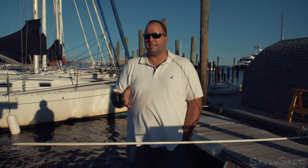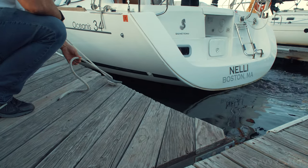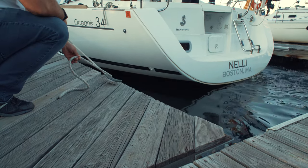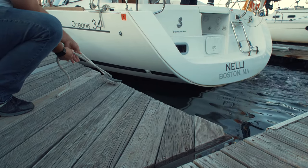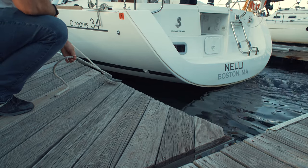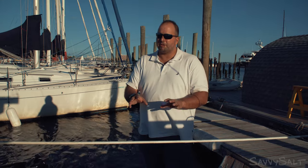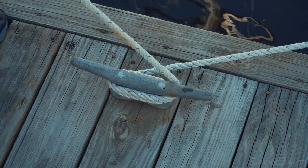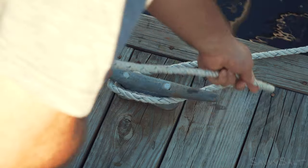A lot of people have questioned whether the combat cleat is strong enough to hold a boat for docking purposes, but I've used it on boats up to 55 feet, and as you can see here it's holding this 34-footer just fine. Another advantage is that you can teach it to someone who's never handled a dock line in their life in under two minutes. Another nice thing is it keeps your fingers clear of the cleat — the captain will be very hesitant to load up the line with 30,000 pounds of boat when your fingers are down there and he can't see if they're clear and safe.